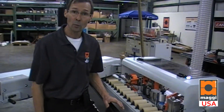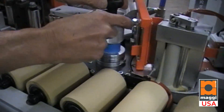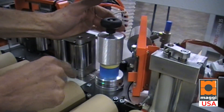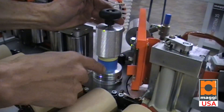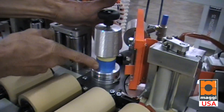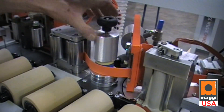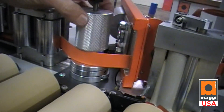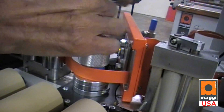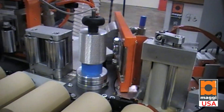There's a very quick and easy way to set up your strip guides on the magazine for error-free operation. The first is this rubber covered roller, which we cover in blue painter's tape — so in case of a misfeed the glue will not stick to the rubber. If it does, just find the seam, pull it off, and put one ring of blue painter's tape around it. To set the correct height, run the top down until it touches, then open it one complete turn and lock it in position with the black knob. Return the banding until it's flush at the guillotine.